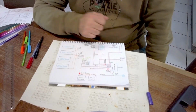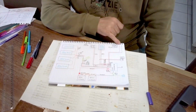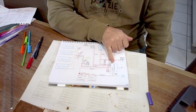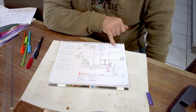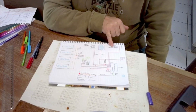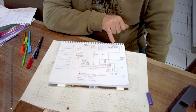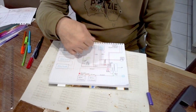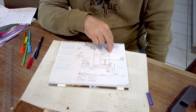So the things that are currently on the van, well, obviously we've taken the power away now from the BM Pro, so we need to run those cables that originally went to the battery. We now need to run them to the Lynx distributor to get power back to the BM Pro. And we're going to upgrade the BM Pro to an HA version of the BM Pro. That will give us 240 volt lithium charge capacity, which means that we can look after our lithium batteries. Currently, the BM Pro, the BM35 that I have on there, is not lithium compatible.